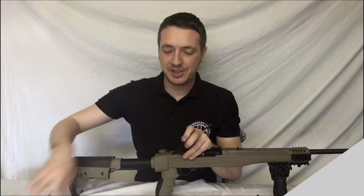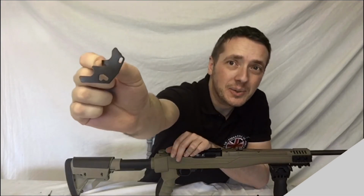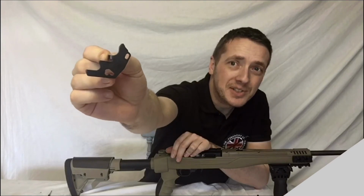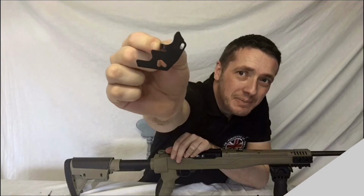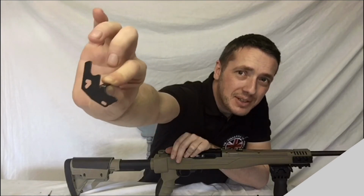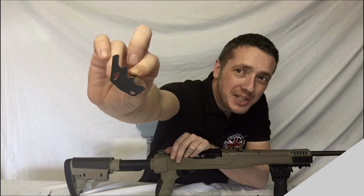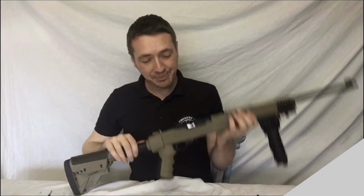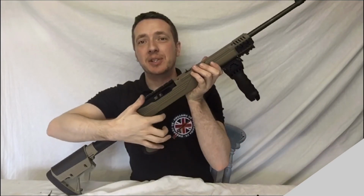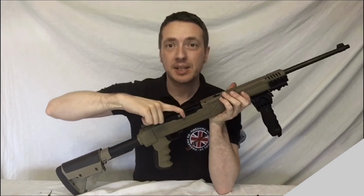but this is the standard mechanism involved with locking it open. I don't know if you can see it, but there's a little nick in that hole, and that's what catches. Let's see if I can, there, you can see it now. Now I got a replacement one that has this nick taken out of it, and what that basically does, instead of having to muck about looking for the mechanism again to lock the bolt, you just pull it back and it closes.